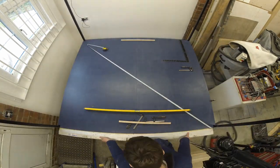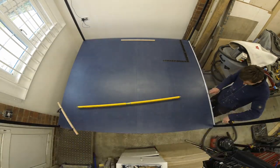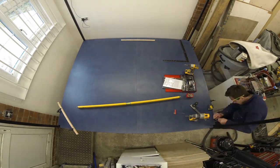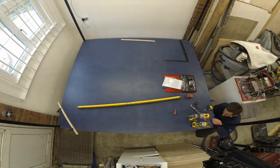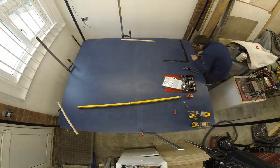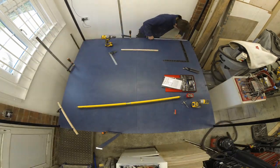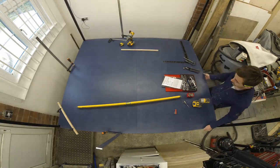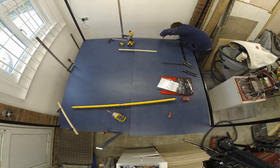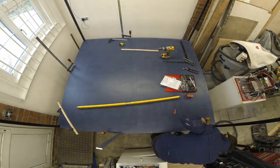You can see that I went around this a couple of times because I wanted to ensure this was square, and once I got one side done I clamped it down. I could go around drilling and tapping holes to take an M4 countersink bolt to secure the plywood sheets down to the metal frame. I started off drilling through the plywood into the metal and trying to tap it all in one go, but this didn't work out too well for me. In the end I resulted to drilling all the way through, lifting up the plywood sheet and tapping the metal on its own. From then the M4 countersink bolts would go through no worries and I was able to secure the plywood sheet down to the frame.